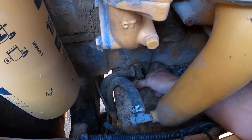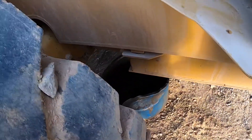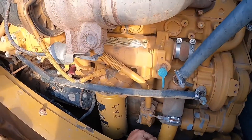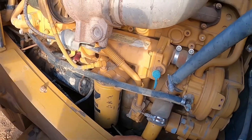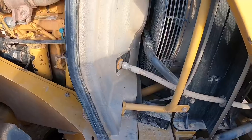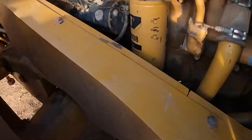Above the engine oil filter is the oil cooler and it holds a residual amount of oil that will run out over the top of the oil filter when you undo it and make a mess. So a good idea is to drive a hole in the bottom of the oil filter and let it drain out while you drain the engine oil. I used a sharp screwdriver to punch the holes through — that filter is pretty weak, it doesn't take much.